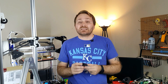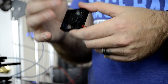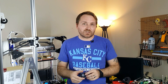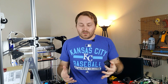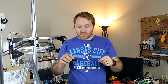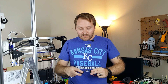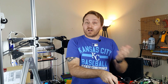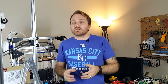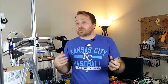The problem with an axial fan is it doesn't have much pressure. The fins are designed for larger volume airflow, not pressure. When it comes to fan ducts and part cooling, you're looking for more pressure than area. That said, I've seen cooling setups using a couple of these fans spread out over the hot end for straight-on cooling without a fan duct — though that can cause warping if not used properly. Axial fans are great for cooling stepper drivers and your electronics cabinet.